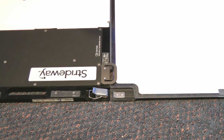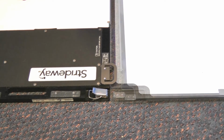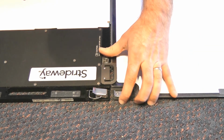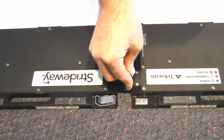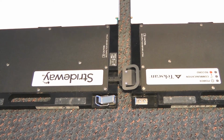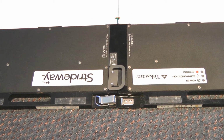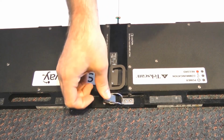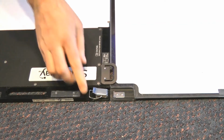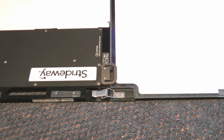Prior to connecting sensors and end caps, verify that all the metal connecting latches are pulled back. This will prevent them from getting caught during the connection process. When connecting the sensors together, first pull the connection tab and insert the male end into the female port of the opposite sensor. Then put the sensors together and latch both ends. Latch the end caps.